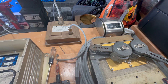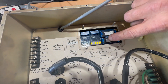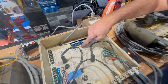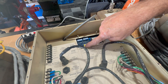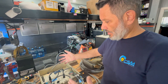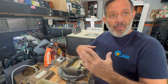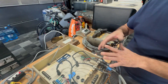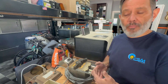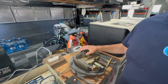And we're into an alarm — this is what he's having. You can actually see that we have an error. The lights are flashing. The error code is two, four, and eight. After looking it up in my database, two, four, and eight is a starboard feedback or starboard high amp alarm. That is an indicator of some sort of issue with the starboard side processor.